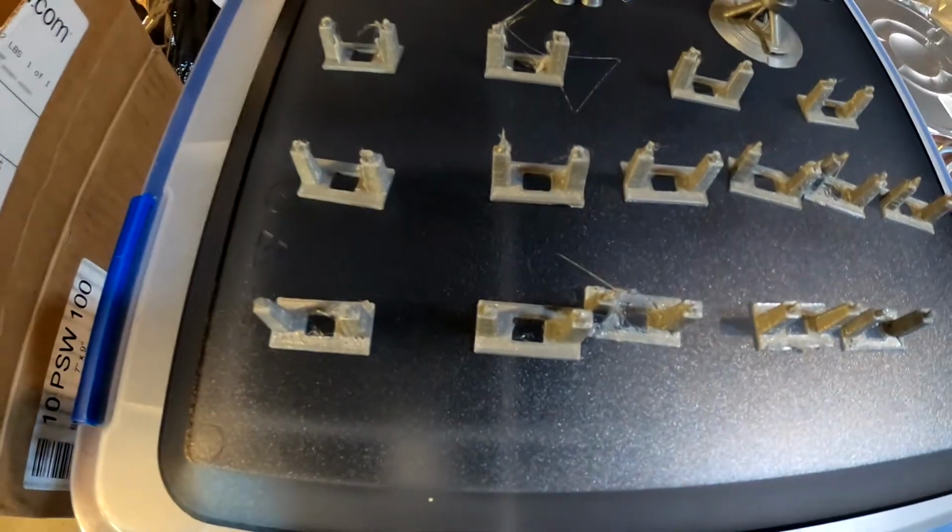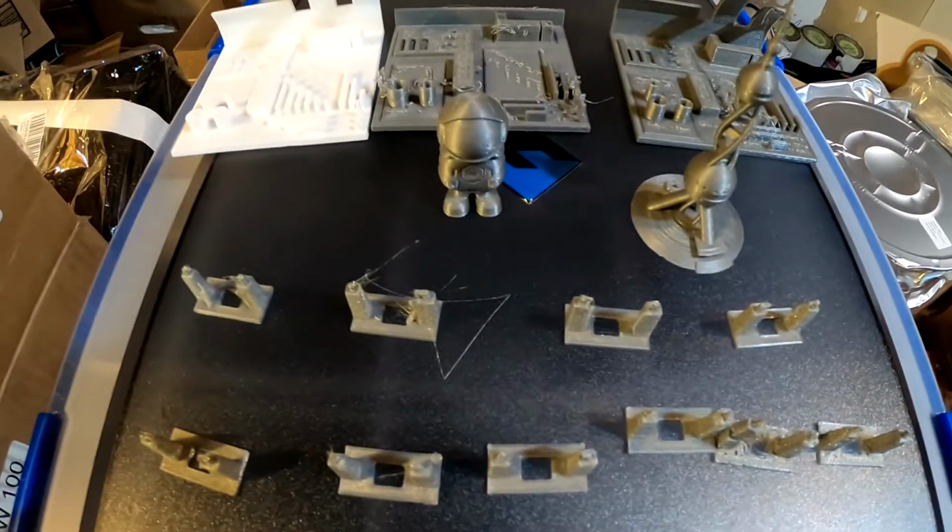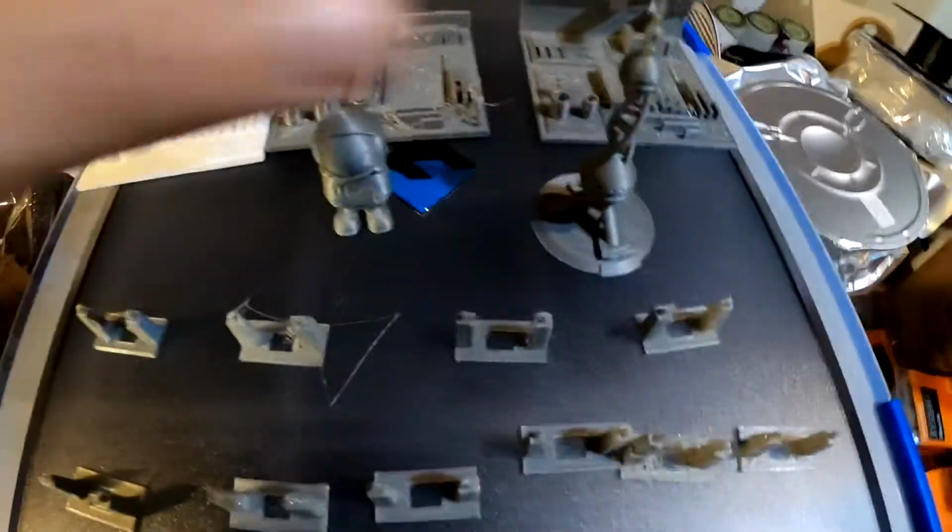All right, well, we kind of obsessed over this stringy tower test. This is the first all-in-one print we did. I noticed a lot of stringing, so I said, how do you get rid of stringing? Found this test and a bunch of suggestions about how to print, and most of them were bad. This is one towards the end, but I didn't bring over the most current ones. But then I found out if you turn the fan on 100% after the third layer and onward, you can print stuff like this. So this is great.